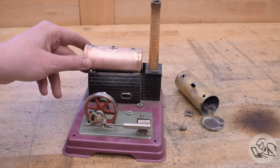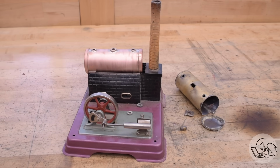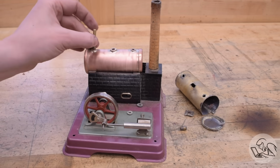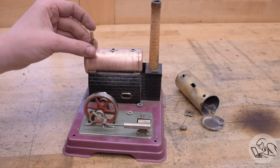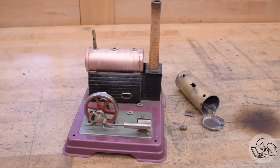Let's see if it looks the part. And there it is in position. I am going to need to modify that sheet metal a little bit to accommodate my thicker flanges, but other than that, it seems like a perfect fit. And the original whistle is going to thread on there. The other fittings were either lost or damaged beyond repair before I got it, so those will be remade, but I think we can salvage the whistle.